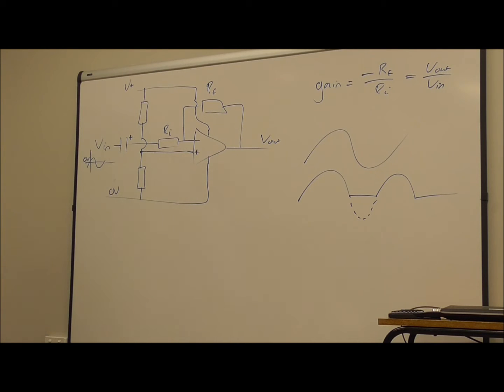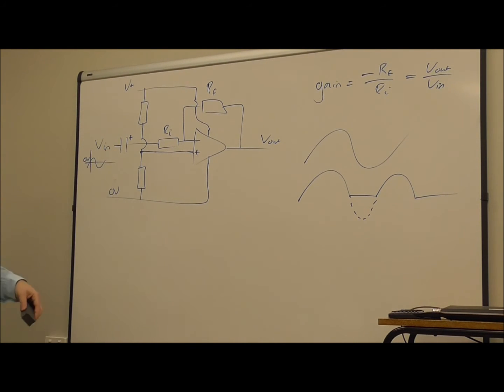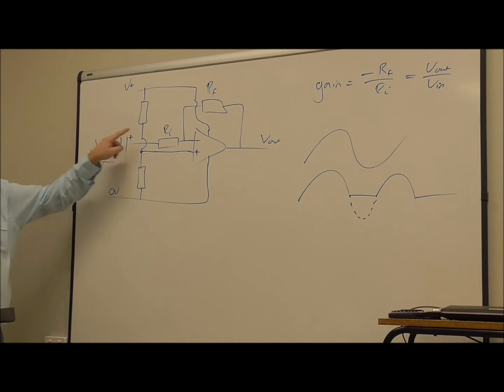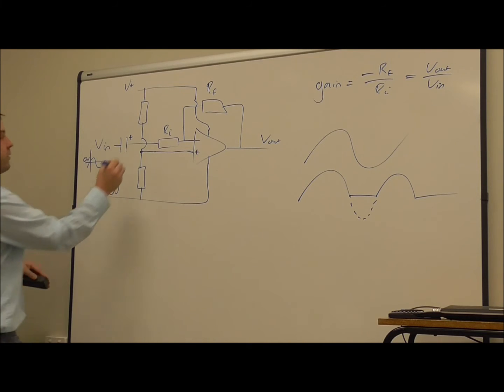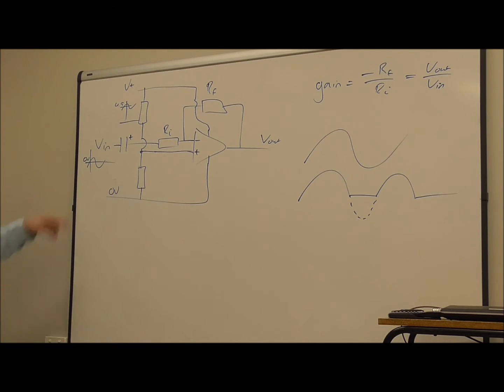On the output though, we might have to have a big capacitor - I'll talk about that in a minute. What this input capacitor will do is, when we first power the circuit up, the non-inverting input jumps to four and a half volts while the input supply holds the other side at zero volts. So this capacitor will just charge up to four and a half volts. If we then put any changing voltage on the input, there's not enough current to change the voltage across the capacitor. So if the input goes up by 0.1 millivolt, then the other side will also go up by 0.1 millivolt, and our signal is passed through but just at a different voltage - biased up by about four and a half volts.